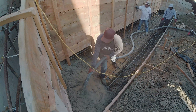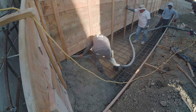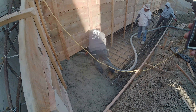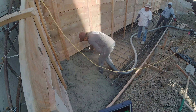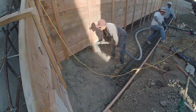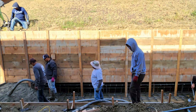With this project it was about 40 yards. We used a six-sack pea gravel mix — once it cures you get about 3,500 to 4,000 PSI. I've been using it for 20 years, so there's no special science to it: six-sack pea gravel, four-inch slump. Shout out to my guy Luis with the concrete pump, always coming through.